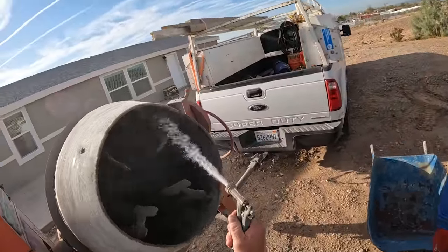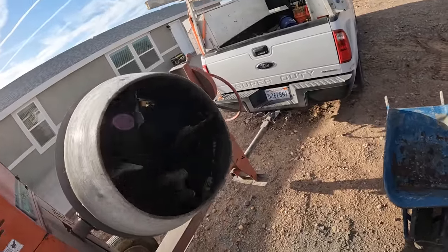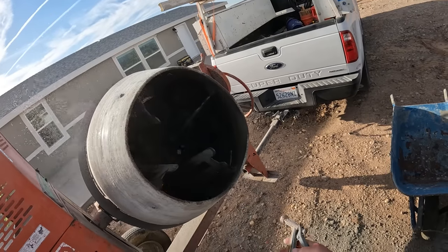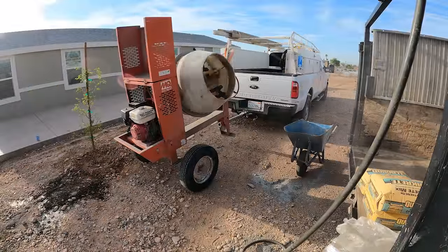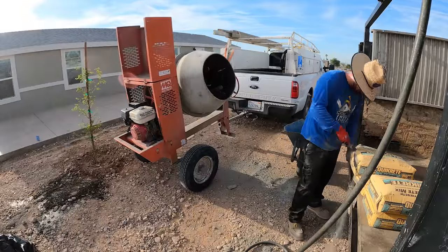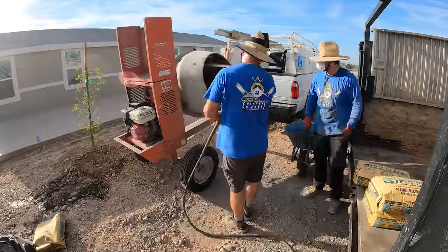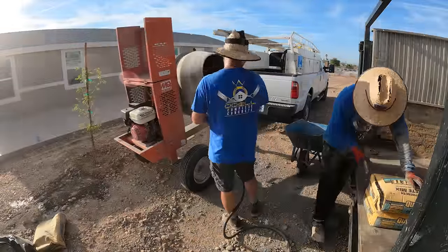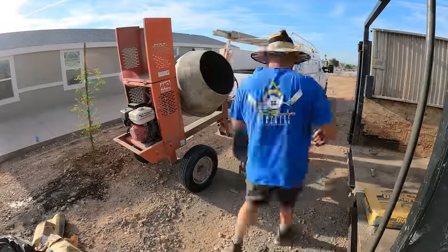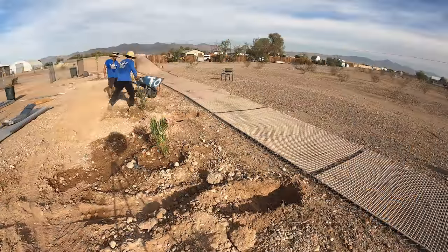What I discovered on those posts we removed — it looks like that particular concrete mix they used, if you could call it that, is mostly probably like a dirt with a little bit of cement in it. Maybe some crushed road base or something, and then add some cement to it. But not really concrete — not like washed sand with washed aggregate and cement. It's just whatever you can kind of find. Because typically you can't crush concrete in your hands when it's dry like that. So that means it's less than 300 PSI.